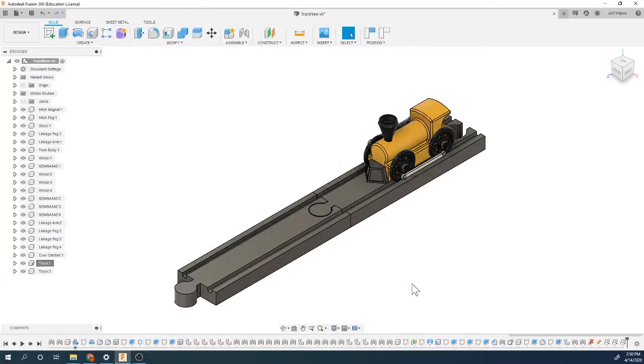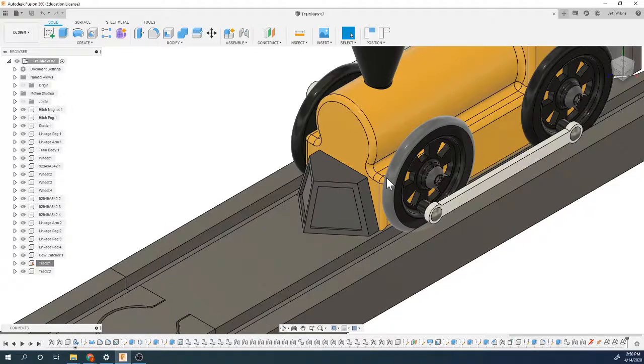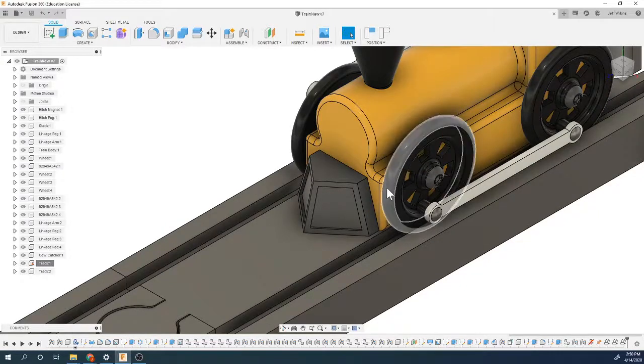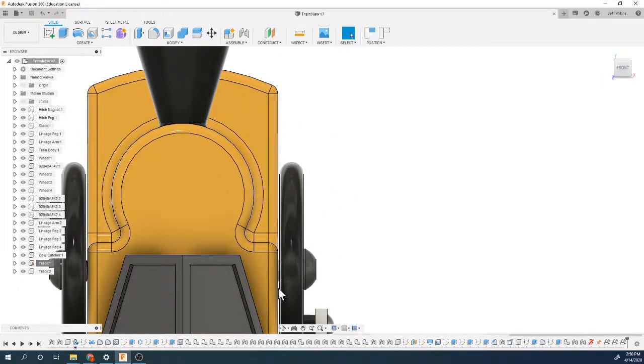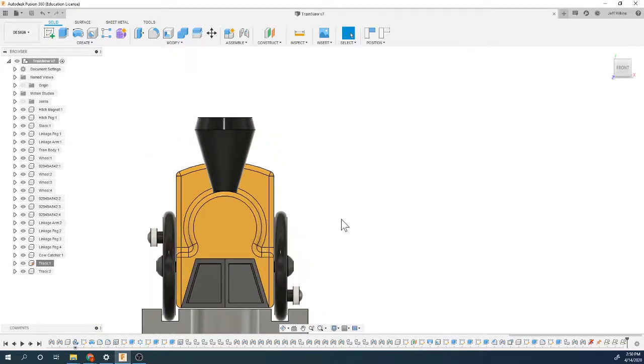There's your train. Let's talk about your car that's going to go on this. A couple things to keep in mind. Number one is that your train car should probably be 2 inches wide. I would have the similar wheel thickness. I think they're 1/4 inch thick. On that, I would have a similar offset. So I think we did 20 thousandths for our offset for these from the body that you're going to be using of the car.